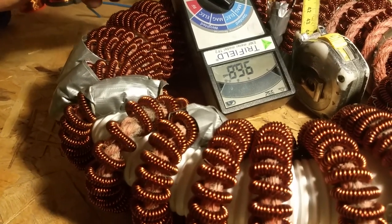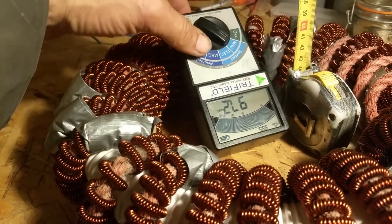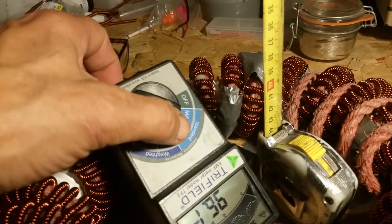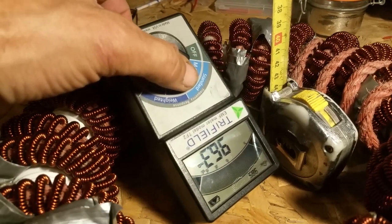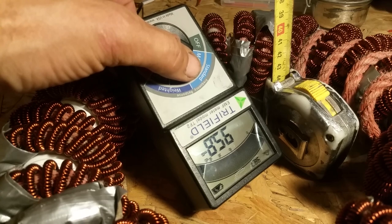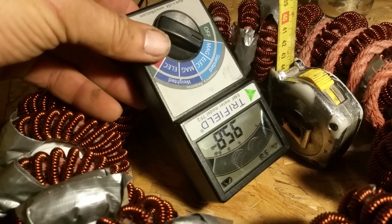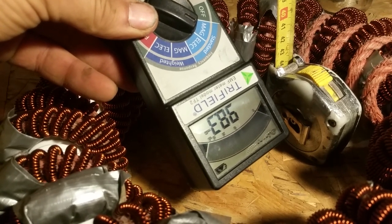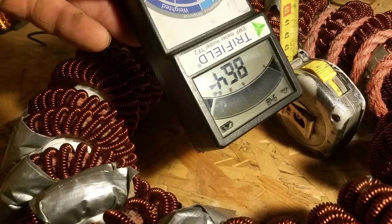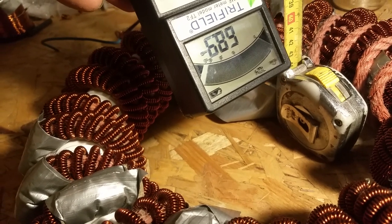A short video on magnetic field strength. It says 40 centimeters up there — I measure here at exactly 10 centimeters from the wood, now reading 96.3. I do it upside down, otherwise I cannot get this meter into this toroid. I dialed the power down to be able to read something, otherwise it goes above 100 milligauss and then it doesn't read anything.